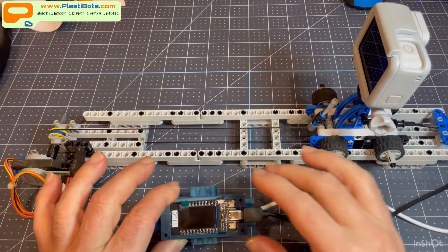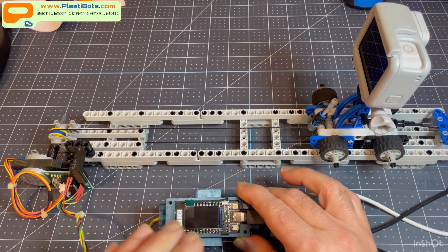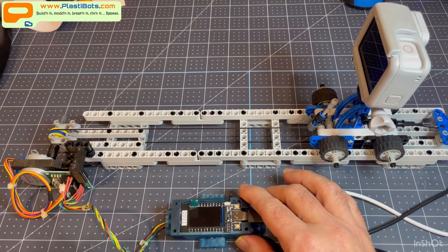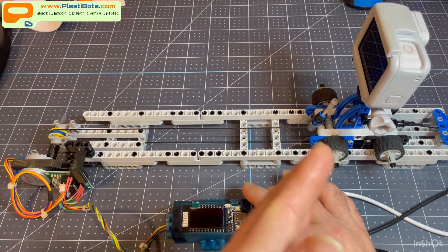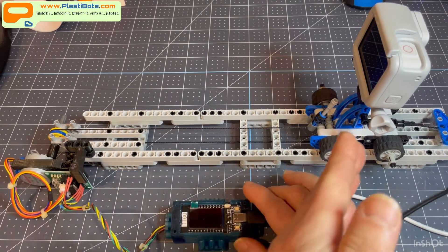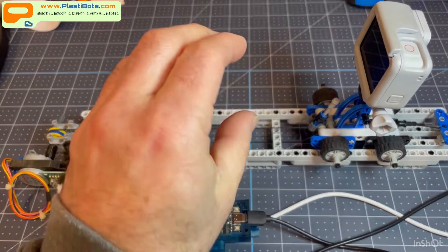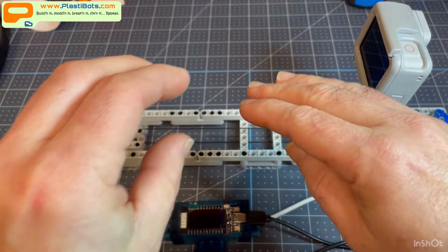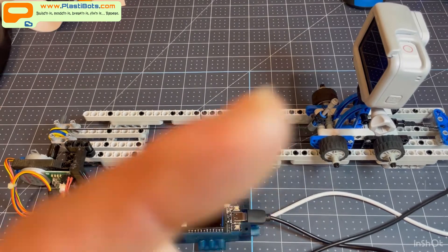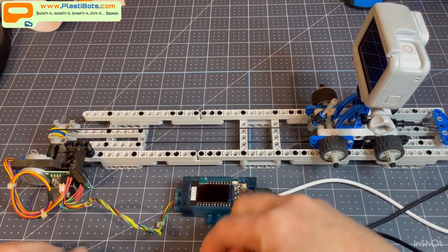I did some testing and a full path running from here to here is about 18,100 steps, so I can use that number with the TTGO. In the HMI interface I can input the actual number of layers the sliced print will be, and simple math determines the number of steps per layer. It can vary depending on the size of the print but never goes beyond the full width, giving a sort of slowly-drawing-back view of the resin print.